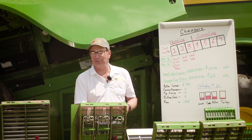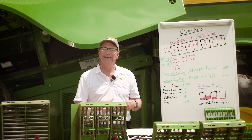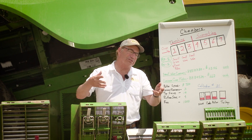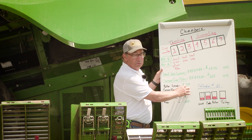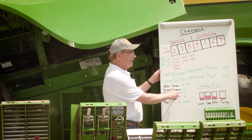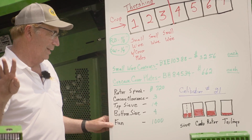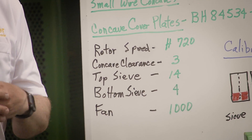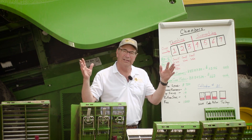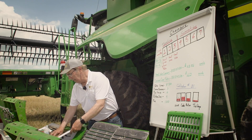I don't know how many acres of wheat you've got, but from an OEM point of view it makes for a real nice machine. We were very pleased with the performance and the ease of setting it up. As for settings, people always ask where we're at: rotor speed in high at 720 RPM, concave clearance at 3, top sieve at 14, bottom sieve at 4, and the fan running around 1,000. That got us pretty close to where we needed to be when combining wheat.